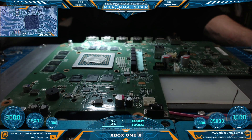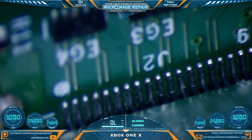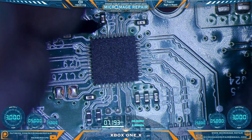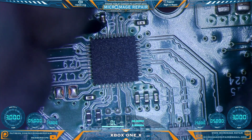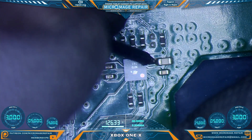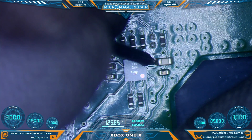Our board is out of the housing and we're prepared to do some testing, but first let's have a look at this HDMI port just to make sure we're not chasing our tail — everything looks relatively solid. Taking readings around the redriver and measuring this capacitor, we're reading 126 ohms, which is very low. What you'd expect to see is in the tens of thousands of ohms. Checking over at the ESD booster IC, we're reading 126 ohms again. We'd be expecting thousands or tens of thousands of ohms, so it's a pretty good bet that our redriver has failed.